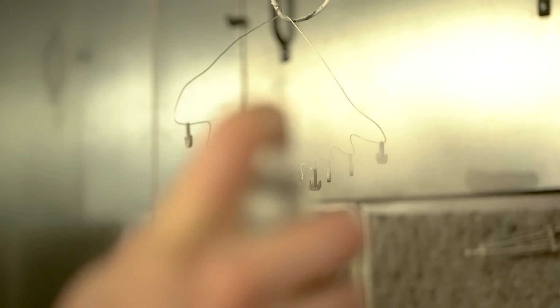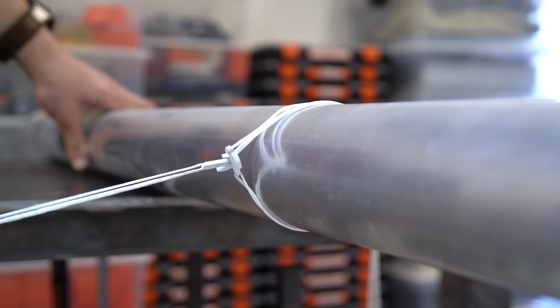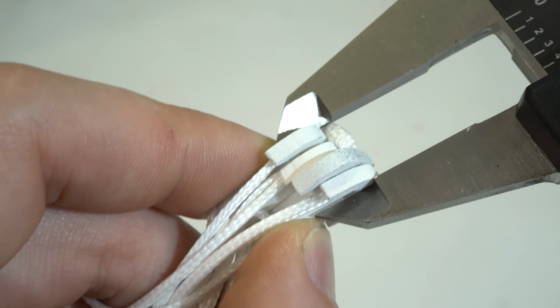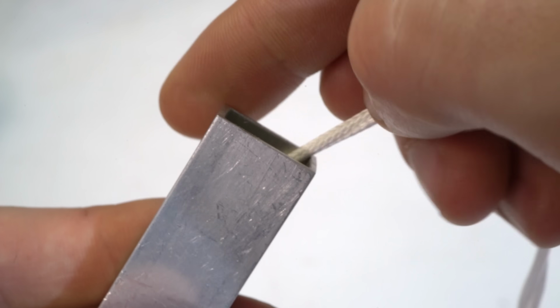I spliced all the loops and painted the hooks white, and the webs were basically done. These are just the boring loop over beam webs, but I've got some more advanced ones I'm working on that I'm really looking forward to showing you next time. Now I knew the size of the webs, I could make the launcher's barrel to fit them. So I started welding some attachment posts onto the valve, made a rubber gasket, and welded up a small square barrel that would fit the web perfectly.